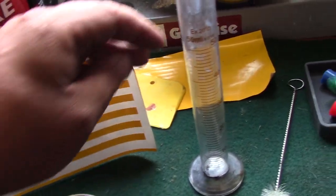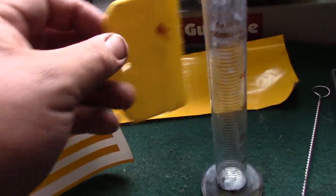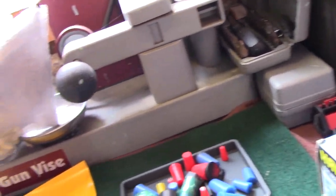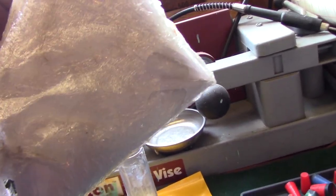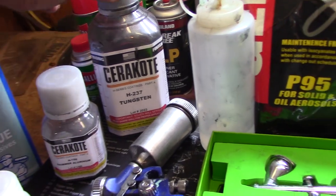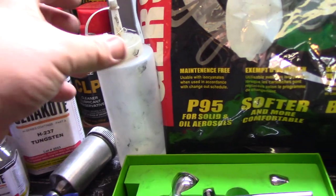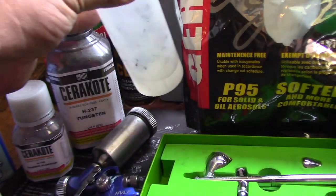You can get stencils from different places — just make sure you use Avery high heat stencils. I use a little bondo spreader to apply them and transfer paper with them. You need paint strainers — 100 micron for the H series Cerakote. This is the activator for it, and Cerakote comes in a small bottle or this next size up, in all different sizes. I use this little squeeze bottle with acetone in it — just a cheap one from Walmart's cooking section — for cleaning.